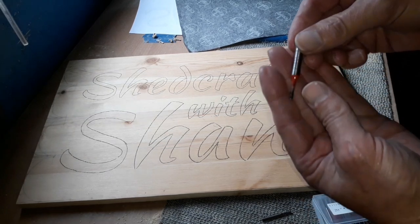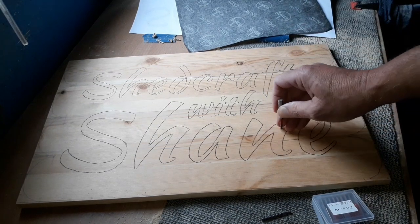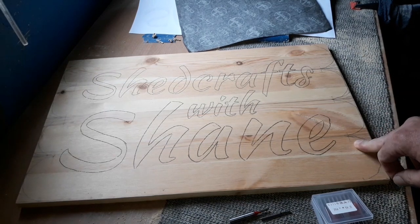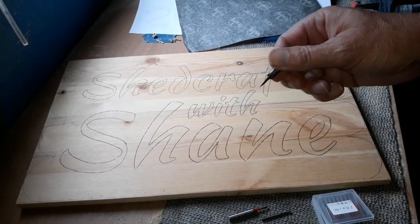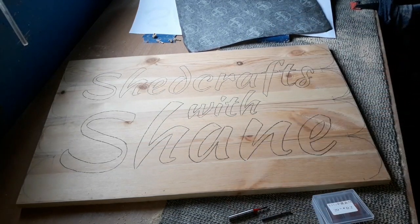Once the CNC bit work is done, we'll come in with our mill end bits — these are really nice and fit the same collet — and use that to go inside the lettering and clear it all out. There is some quite big lettering on this, so if it's taking too long there's a straight metric one-eighth bit that will get it out a bit faster. It's quite decent wood for something that was free, and it comes out fairly good. So we'll set our CNC bit up in the router and start going around all the lettering.